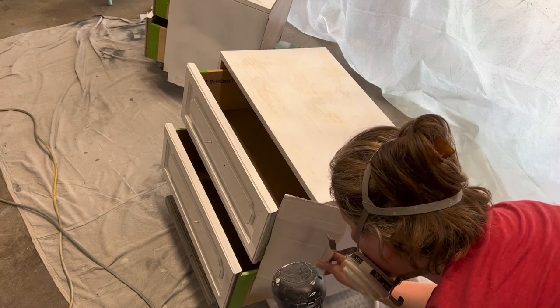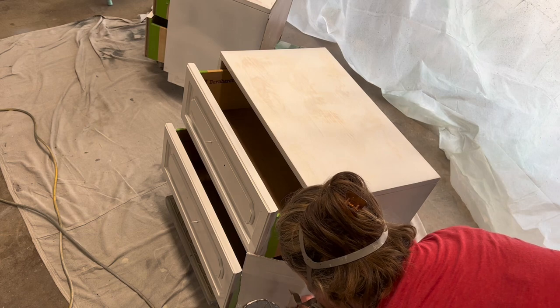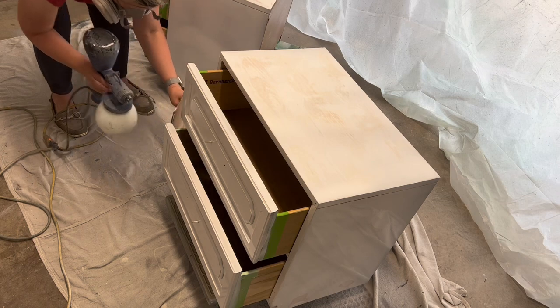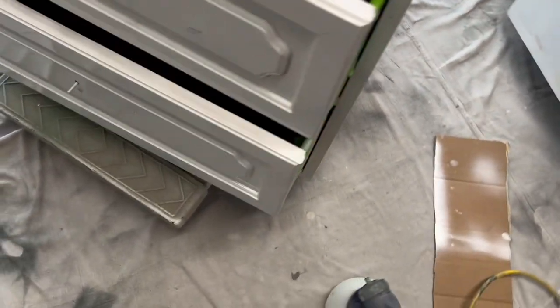You can see I'm using a piece of cardboard to spray the edges. You can use your sprayer, or just come back through with a paintbrush to get those edges. Here's the bleed-through I was talking about — anywhere that I sanded to raw wood, you can see tannins coming through the primer. Again, it'll come through on the first coat, just do a light sanding, go ahead and do a second coat, and that will seal it in. Then you can continue on with your paint.